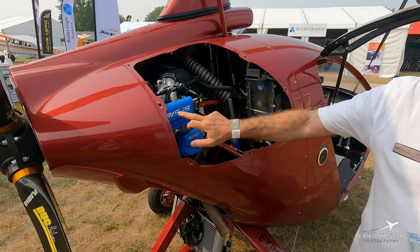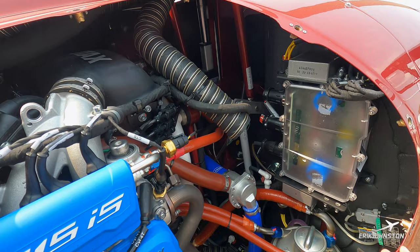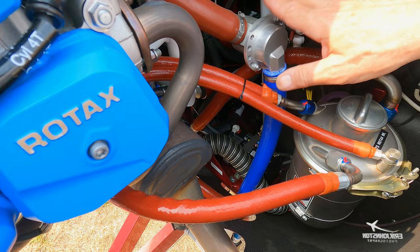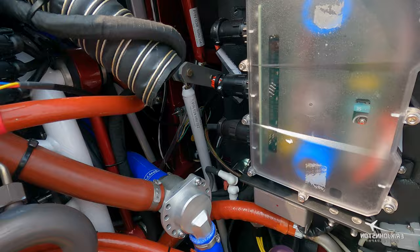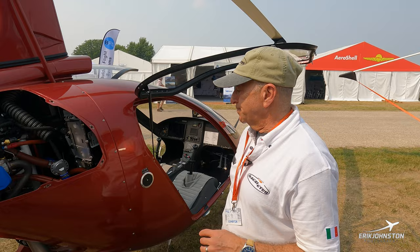Coming around the right-hand side, the cover is off the engine. As I was saying, this is the Rotax 915 IS — fuel-injected, turbocharged. This one also has heat into the cabin; this hose provides that heat — currently disconnected. The engine control unit is here. You can see the cylinder heads, the muffler down here, water control valves, and the oil tank. Something really interesting here: this is part of the control rod assembly I mentioned earlier. The lower control rod goes to the stick up front — you can see a pivot point — and the upper control rod goes to the top of the rotor. You can see exactly how the connections run from the stick directly to the top of the rotor.